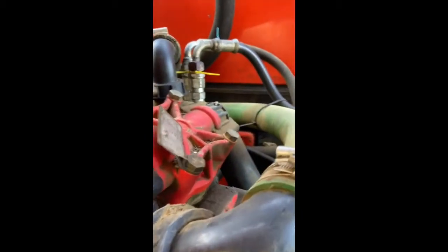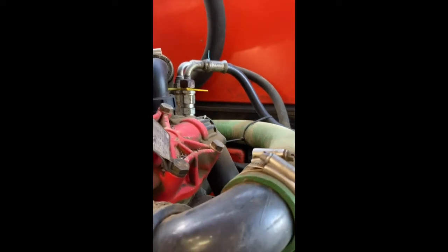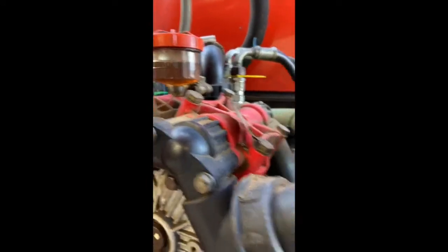Because the quick releases don't need blanking off, the pump boom stays in the air so you don't need to prop that up. You just take that off, take that hose off, take that hose off, and do those four bolts. We could take that pump off in five minutes as opposed to half an hour before.